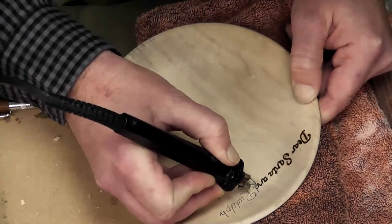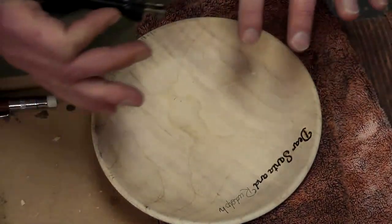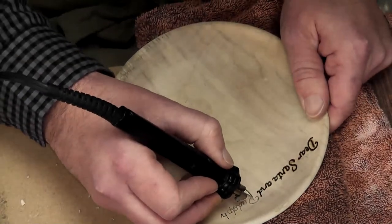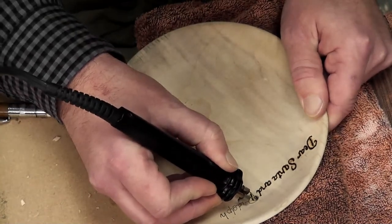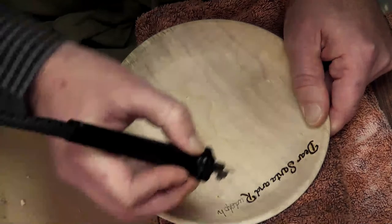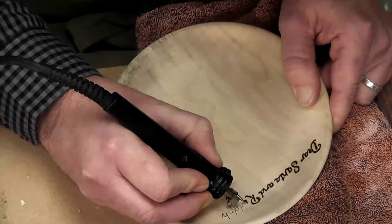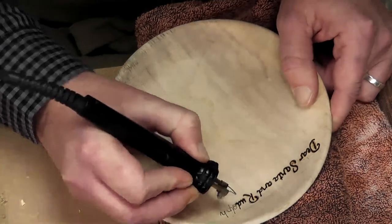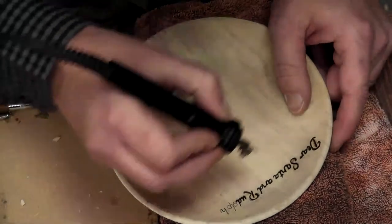So, really quick and easy, this is just like writing with a pen. This piece of sycamore is really smooth. It's like silk, really stable across the grain, so you don't get that crazy fast summer growth and then the really hard annual rings in the winter. It's really stable across the grain, and that's what you want for this type of writing on a piece of timber. Otherwise, you're skipping across the grain and it dips in here and there, and you'll get lots of little blobs.